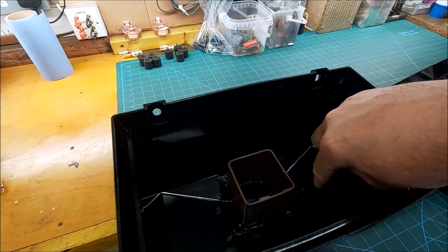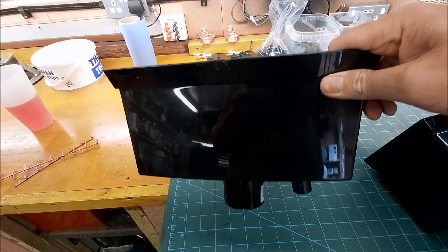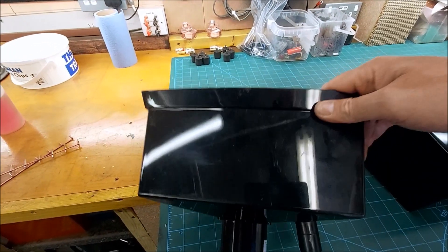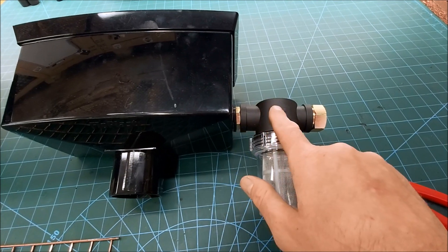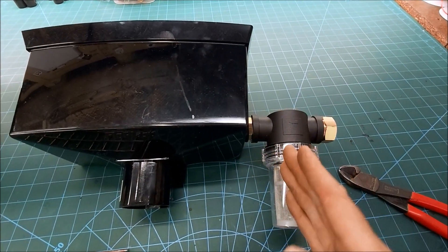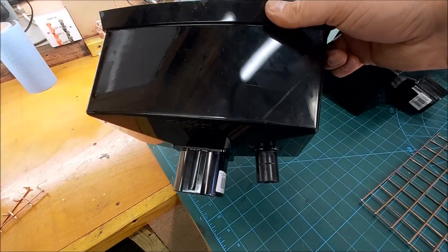If the rainwater butt is full, this will fill up and overflow, so it's important that I get the level correct. The top level of the rainwater butt probably wants to match the top level of the pipe in here so water can overflow back through it. These coarse filters, whilst they filter the water going into the rainwater butt, when the butt is full and starts overflowing back, it washes the filter back out, which should then wash back down the downpipe.